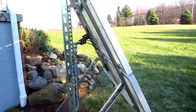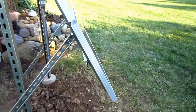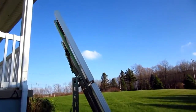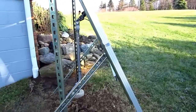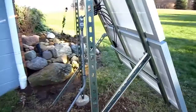Currently this angle is set at 26 degrees to capture the winter sun. I can set it using the angle adjusters to various angles at different times of year — in summer it'll be set to 72 degrees, so it'll be almost horizontal. Your angle of incidence will vary depending on your latitude, so you can look that up online.